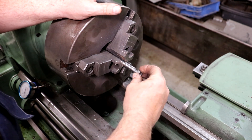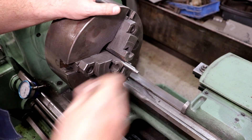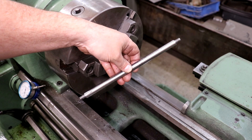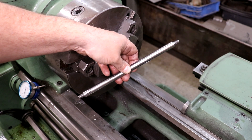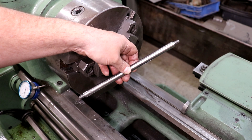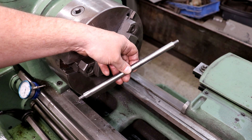Just to confirm — there's a nut with the threads that we want and we're able to thread right up on it. So real simple part. Like I said, I started not even planning to show a video on this, but I thought you guys might enjoy seeing that little die tool you can use on the lathe for threading. If you're uncomfortable doing single point threading, that is a quick little cheat — it works just fine. I still prefer single point threading in most situations, but if you've got a lathe and you're scared to try single point threading, get over your fear. Go out there and practice. It's not near as hard as it looks. On something short and to a shoulder like that, a die is a good option.